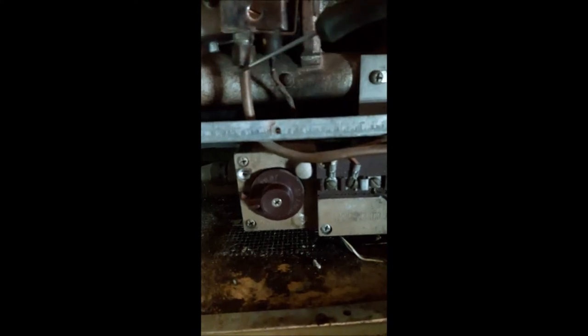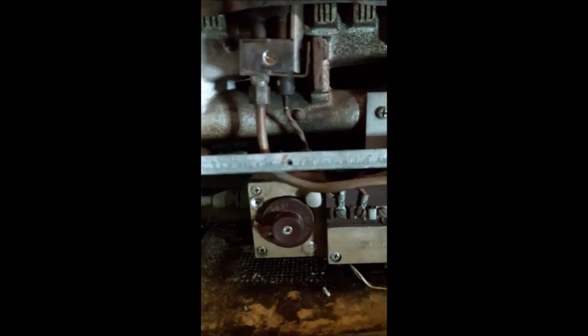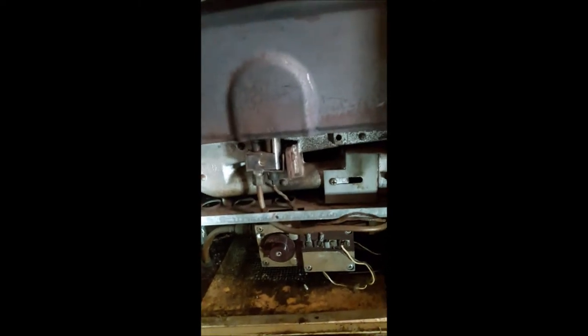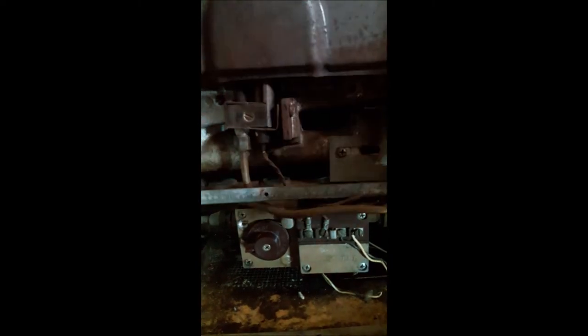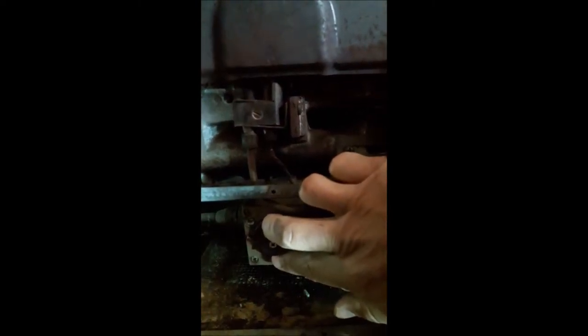I adjusted it and cranked it out three times. I felt a little dumb after I figured it out, but I'll blame the instructions — because the instructions don't tell you to press down on this to get the gas to flow through to the pilot. It just says: turn it fully clockwise, light the pilot, turn it on. It doesn't say 'depress to begin the flow of gas,' but that's standard on so many furnaces.